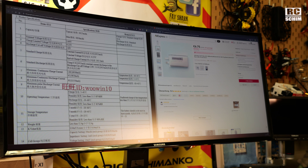These cells go up to 4.25 volts and you can discharge them down to 2.8 volts. For normal lipos you should stop flying at around 3.5–3.6 volts, whereas lithium ions you can go down to 3 volts, or like these here, 2.8 volts.